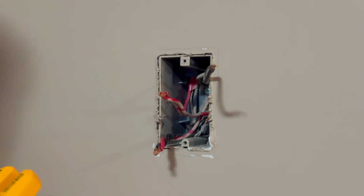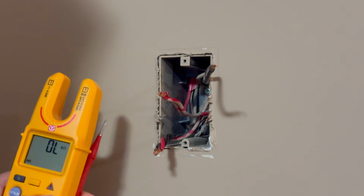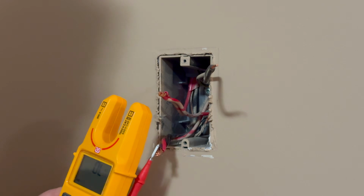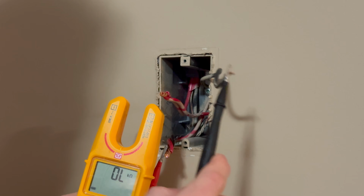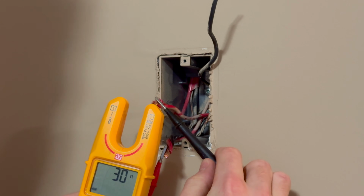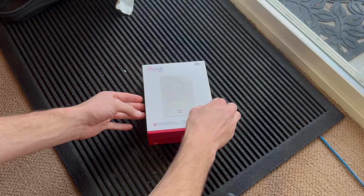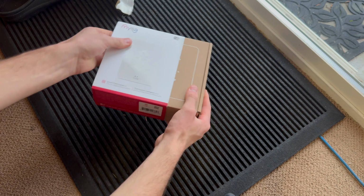So what you can do is do a continuity test, and because the resistive heater will show up as basically a short circuit right through because it's a resistive load, if you get a solid continuity test, you know that's your load side. So there, like I guessed, this is completely open, so this is your power coming in, and there you get continuity, so you know that you're metering the resistance through the heater. I will open up our thermostat here on the floor by the door where there's some better light. This has already been opened.